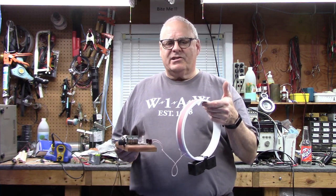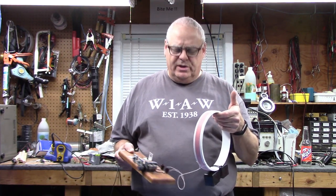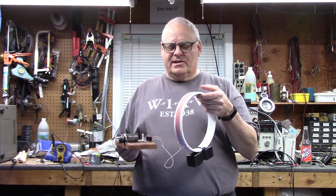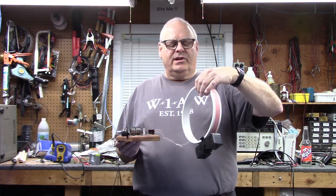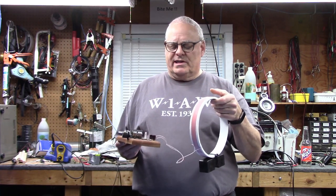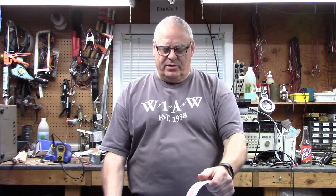I'm going to use SDR Console 3 with the SDR play RSP2 on the high input impedance side, and we'll sweep through the whole AM broadcast band. You can see just how selective this is and how that would eliminate an overload problem, along with the ability to tune to what we want. The selectivity and where your loop is resonant will become painfully obvious. Let me set up for that — I'll be right back.